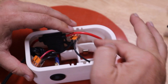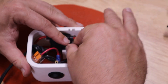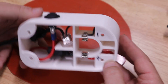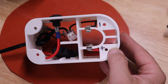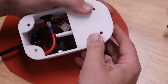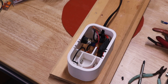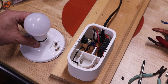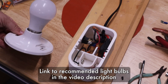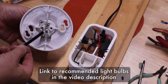Just make sure all the parts are tucked down out of the way of where the battery is going to go — and that's it really. The backer plate goes on the back to help hold those spring contacts in place. For the other end of the wire, I've got a plain inexpensive light bulb holder and a DC light bulb that can run on 18 volts, so I'll strip the wires and connect them to the bottom.